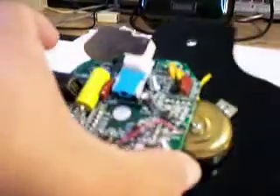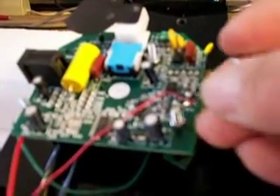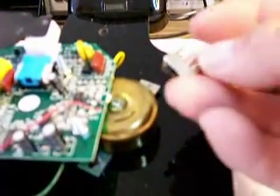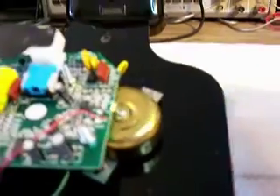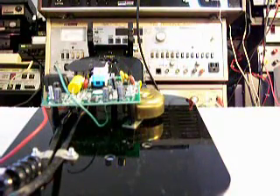We have some bell clearance here from the board to the bell, and we haven't tightened all the screws down yet — there's a rubber washer underneath here that will collapse a lot more when I tighten that down. Basically, there was a switch we removed from the circuit board that was hanging down below the board about where the bell was. It was a switch for high and low on the ringer element, and since we don't need this switch it was just in the way. That switch did not come out of the back of the telephone, so unless you took the back off you'd never have known it was in there — it's not going to hurt a thing for it to be gone. What you see here is the ringer element that we put back on real quick — I'm going to remove that since we're not using it anymore. I just wanted to show you what it sounded like when it did have a ringer on it.